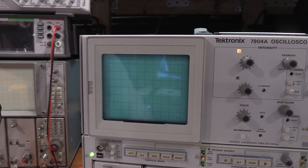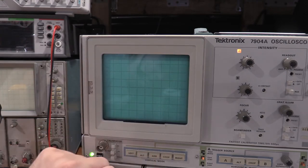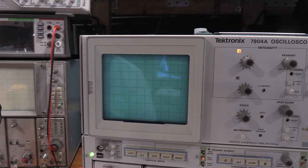As with every calibration, it starts with a preliminary procedure. In this case, it's display mode to channel 1. And I'm going to make some mistakes on this because the knobs haven't come in yet, so I'm going to do this blind, but we'll see how it goes. Triggers mode, so that one's not going to have to be changed. Channel polarity is up. Bandwidth is full. Positions are mid-range on both channels. Volts per division is 10 millivolts. There's 10. And AC and DC is DC. That concludes the preliminary setup.